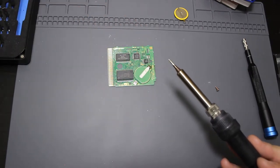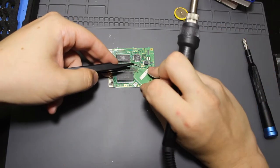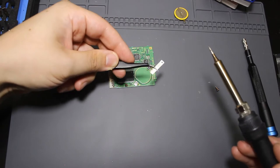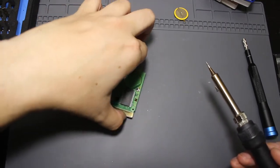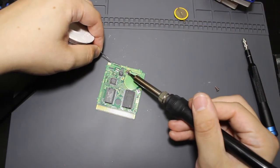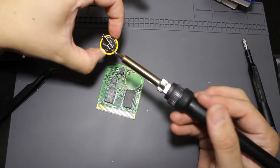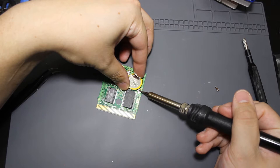What I'm going to do is try to desolder this, so I'm going to grab my tweezers and desolder this battery. Okay, I got that one off. Let me go ahead and take this other leg off here - see if I can get under it. And bam, that's going to be both of the legs off. So I'm actually going to put on a little bit more solder - this side looks like it has plenty of solder but this side looks like I took some off, so I'm going to put more on.